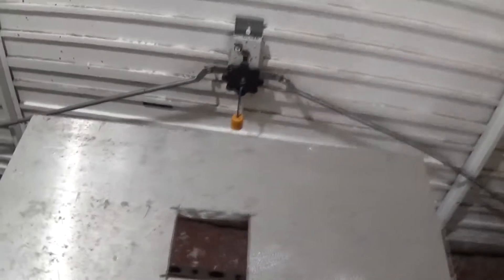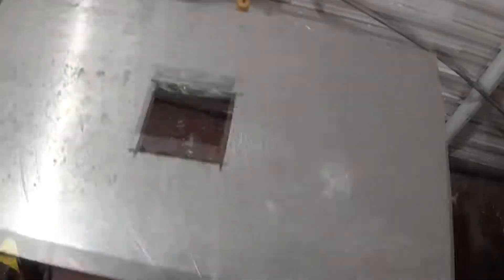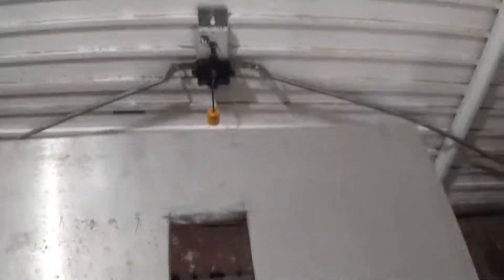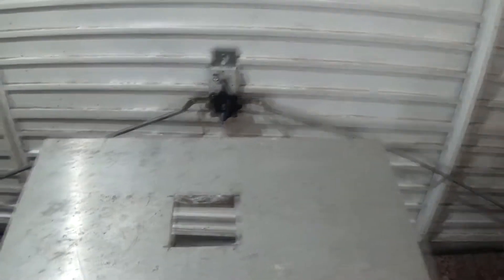You can see by the shape of the hole that the drill didn't work — the pilot bit snapped off as I was going through. It is quite thick substantial metal at the end of the day. It's quite a messy job and I'll just use a jigsaw to clean the corners up a little bit. That's the whole pilot hole through. What I'm going to do now is offer the gearbox up onto the plate, draw around it and mark the top of the gearbox to get the orientation correct with the motor.